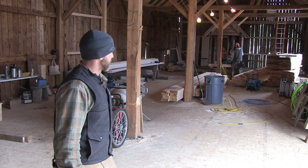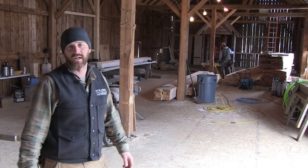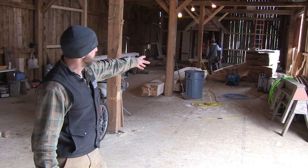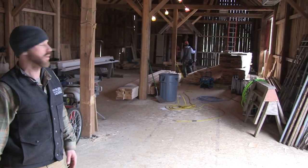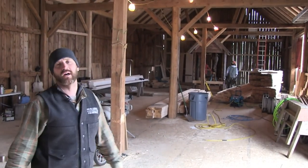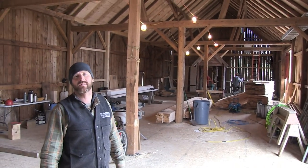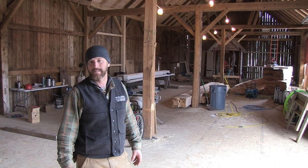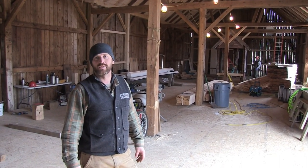So a couple guys working on that. Chuck and Evan are over there trying to re-side that. And like I said, subfloor is done. We got our novelty siding here, waiting on a coat of paint. And we got some inside work to do, sistering on some new materials to kind of beef up some purlins and some rafters and such. And getting close on a lot of stuff.